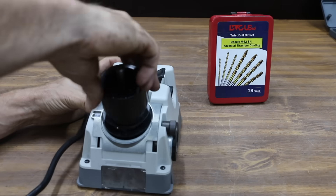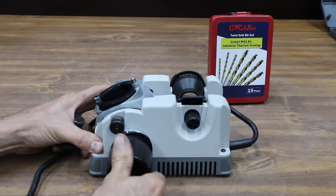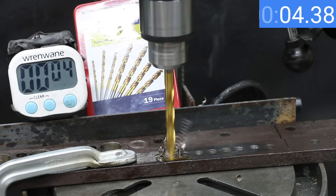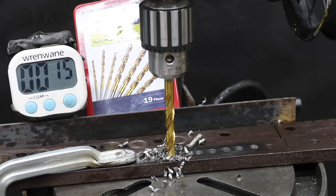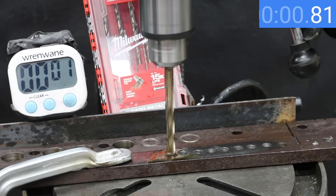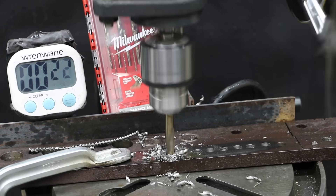While it's not a fair test, let's sharpen the LW to see if we can get some use out of it — creating a 135-degree split point and removing all the damaged metal. Surprisingly, the LW, which wasn't even able to cut through mild steel before, is now making very quick work of the spring steel and drilled the fastest hole yet in only 14.7 seconds. Unfortunately, the LW is just way too brittle and once again experienced a lot of damage. The Milwaukee claims to be fast in hard material, and it's definitely drilling a lot faster than average — not counting the LW, Milwaukee's 21.06 seconds is the fastest time of all the bits.